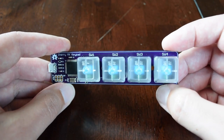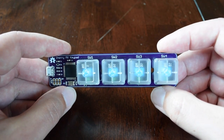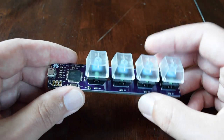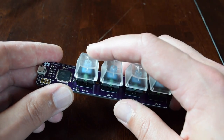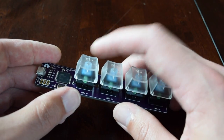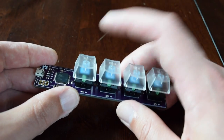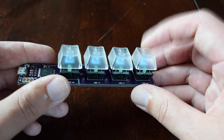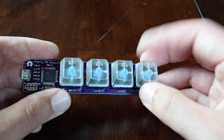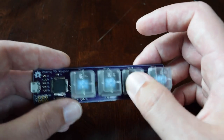So what is this? Well, it's a HID, or a human interface device. Basically, when you plug it into your computer, it looks like a mouse and/or a keyboard. And by programming the microcontroller, you can have these keys send whatever you want when you press them — it could be a single character, a number, a mouse click, or even a sequence of key presses and/or mouse clicks. You could put delays in the sequence. You can do pretty much whatever you want.